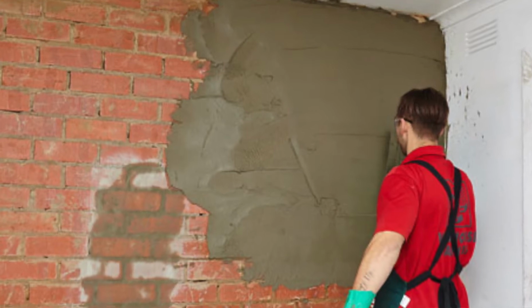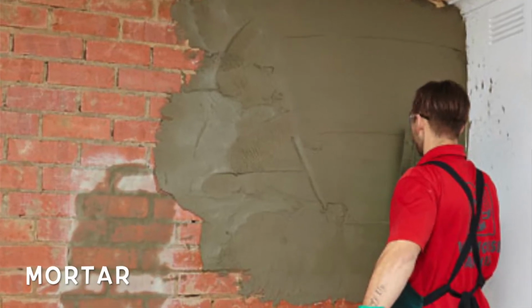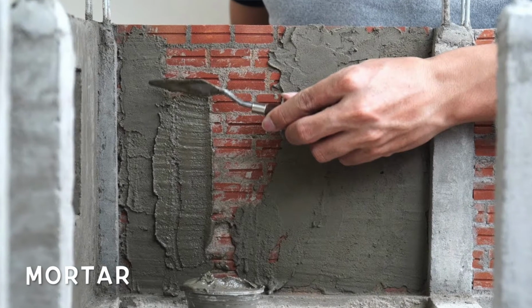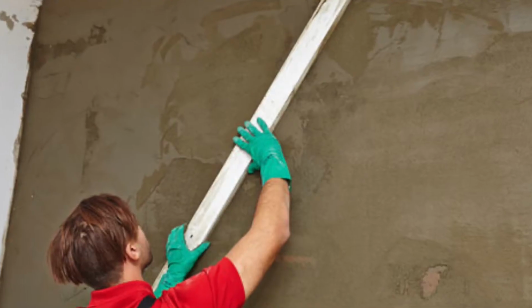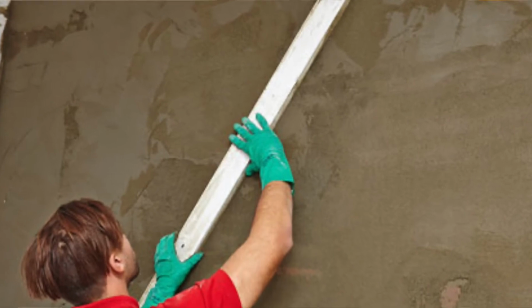Once the walls are constructed, we need to plaster these walls using materials such as sand and cement in a combination in the ratio of 1:4. The plastering process provides a level base to the wall and also gives it an extra strength.